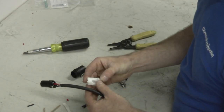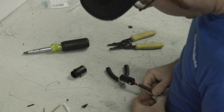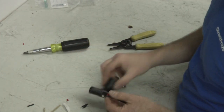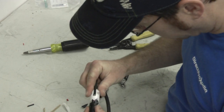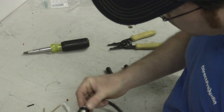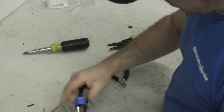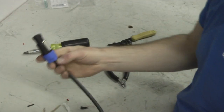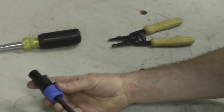We're gonna take our white little strain relief here and add that onto the cable. You can actually put this on first too — if it's a larger cable, sometimes those are difficult to get on. Then the notches will line up, and if you just rotate it, there's only one way that it fits on there. Screw the back of the connector on there, and there you have it — one NL4 FC connector installed onto a two-conductor cable.